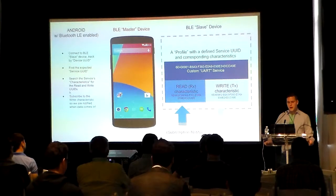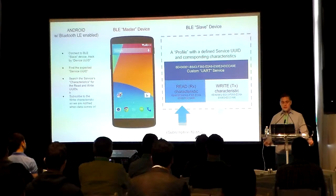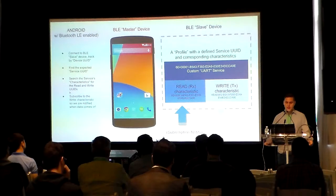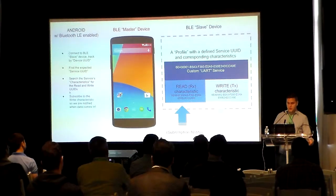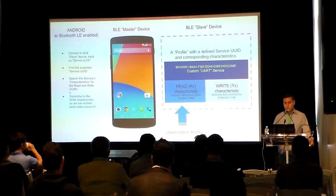Unlike Bluetooth 2.0, BLE does not simply provide a serial interface for using AT commands. BLE works with profiles instead. A profile is simply a means to define a wireless communication between BLE devices. Bluetooth Low Energy chipset vendors usually have tools available that let you define your own BLE profiles and configure the BLE chip according to what you specify. One of the most commonly used profiles is the serial port protocol, which is intended to replace the serial cable between devices. Some of the most popular Bluetooth Low Energy chips come pre-configured with the profile, so you only need to know a few details about it without becoming too concerned about the configuration.